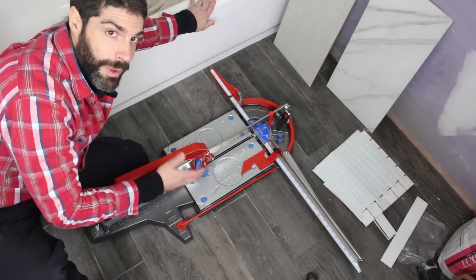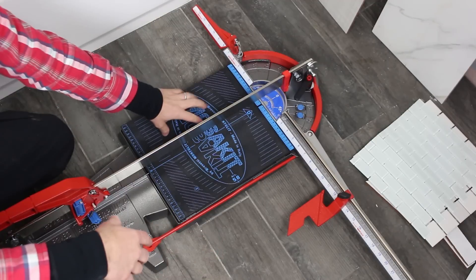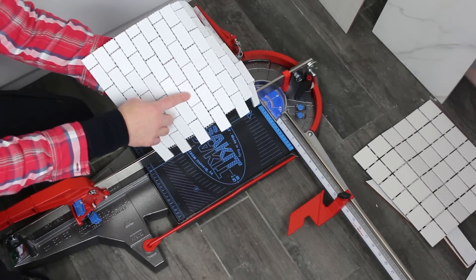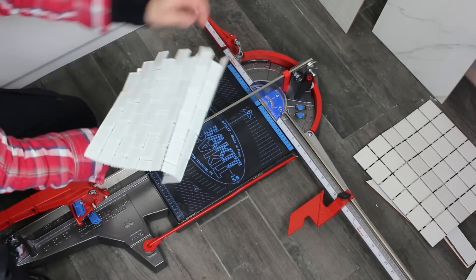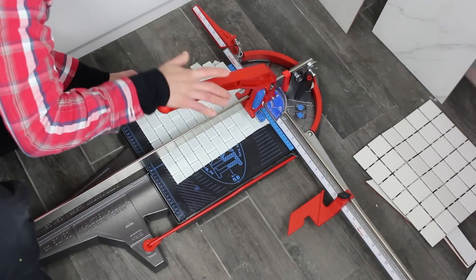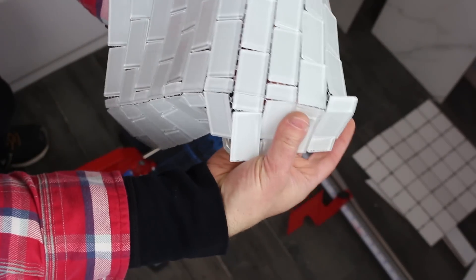What about glass tile? How do you cut that with the Master Piuma? You can get a rubber mat for it — the rubber mat has a little groove on the back, and that groove fits into the slot on the Master Piuma. The rubber mat keeps your glass mosaics on the Master Piuma, and the other thing is most glass tiles have a white paint on the back. That white paint can be chipped if you don't use a rubber mat. If you chip the white paint, you'll be able to see the thinset through the glass tile, which is never a good thing. It's very simple to cut glass tile with this tile cutter, and as you can see, all these glass tiles were broken perfectly with the Master Piuma.